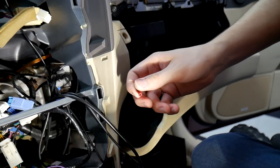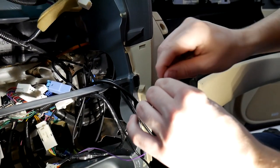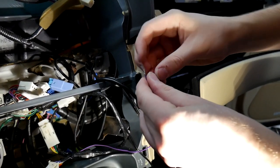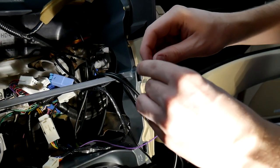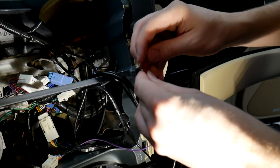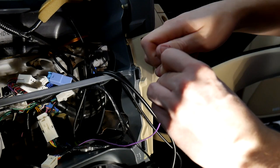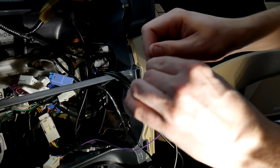We've got our p-tap here and our wire stripped at the very end. Turn the wire together so it's not frayed out everywhere, then unscrew the p-tap fully and put it on the wire. You'll see there's a tiny little bit of wire exposed — just push it in and twist. If you pull slightly, just a little bit of a tug, just to make sure it's fully seated in there.